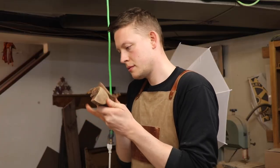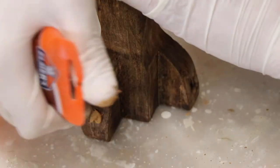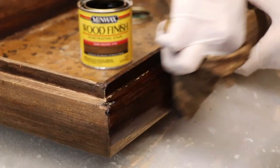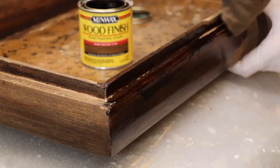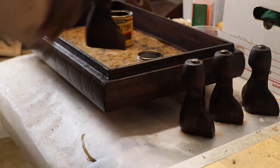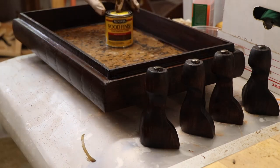Now, the legs were completely broken off, so I was able to fill in all the holes and straight up glue them on. This is not perfectly flat, and I chose not to correct that because it's going to a home that is carpeted. So when it's done on nice thick plush carpet, you'll never know. On my hardwood floors, or this tabletop, obviously you do see that, but in the final project, it won't matter.